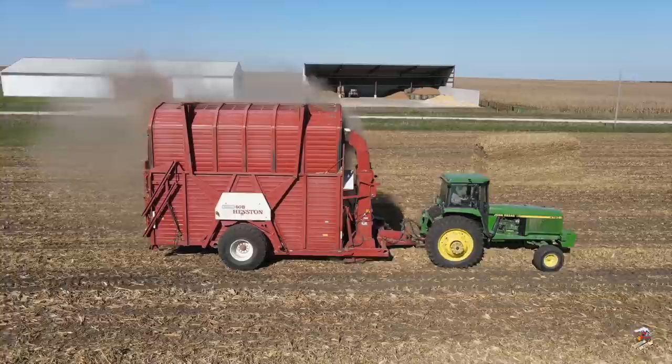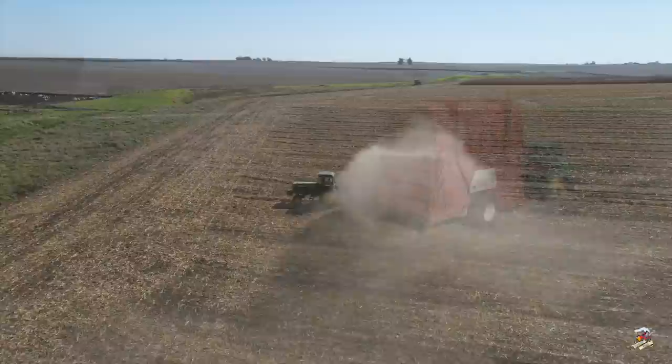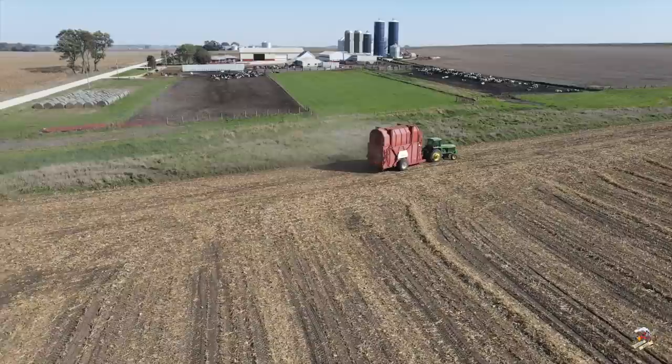These were built in Waterloo, Iowa from 1992 to 1994. And this machine was powered with a John Deere 466 cubic inch or 7.6 liter six-cylinder turbocharged diesel engine. These were rated at around 175 PTO horsepower, and you had a choice of transmissions in these. You could get the quad range, which was a 16-speed, or the 15-speed full power shift transmission. This model was later replaced with the Model 8200.